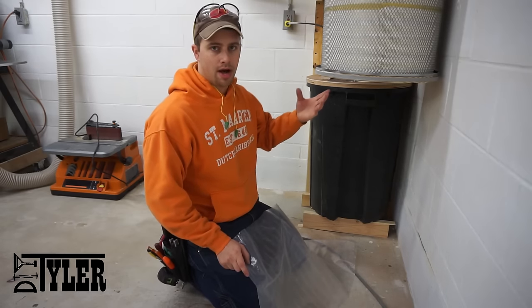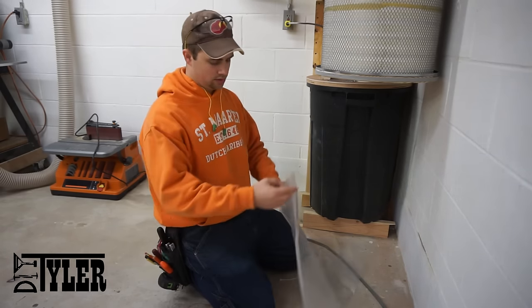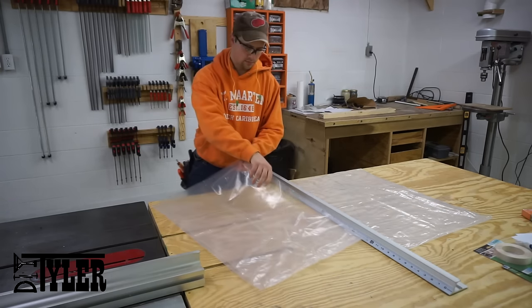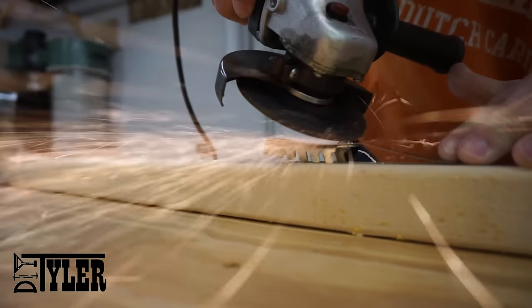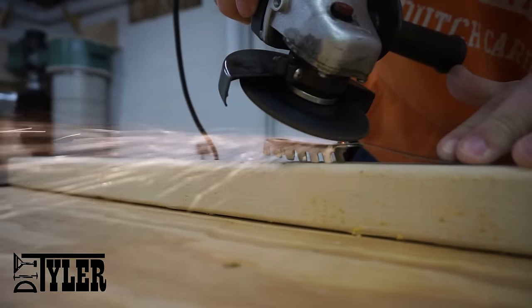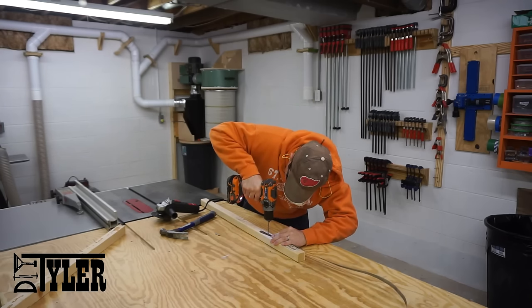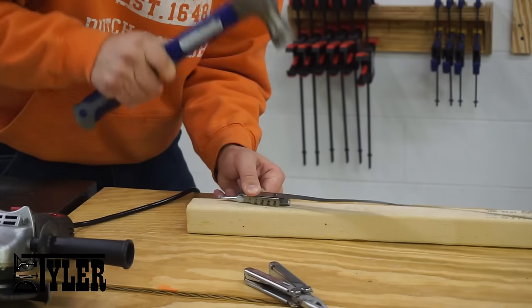To close off the bottom of this filter and to push the air through the filter, I'm going to use this typical 20-inch diameter dust collector bag that I was able to get. I cut it down real quick, and I'm going to use the band clamp from the original Harbor Freight dust collector, which I had to shorten just a little bit. I ground out the rivets and pounded some bolts in and mushroomed them over to act as rivets.